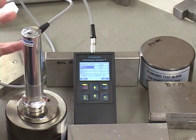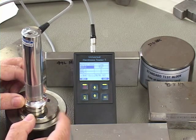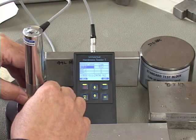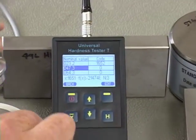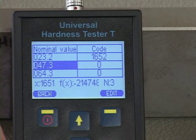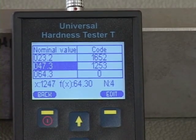It's showing a code of 1647 — this code value will be stored with the device once calibration is done. You never do just one test because there could be user error; we want to average multiple tests for the most accurate result. Moving the puck and doing a second test, it went from 1647 to 1642 — a tiny variation, so that's good. Scrolling down to the next block, I ring it to the heavier base so it's seen as one material, then complete the test three or four times with very little variation. Then the last block at 64.3: I scroll down and do a series of tests.